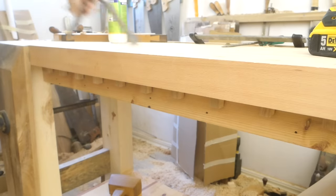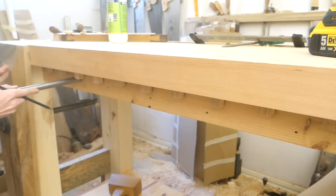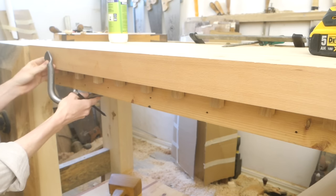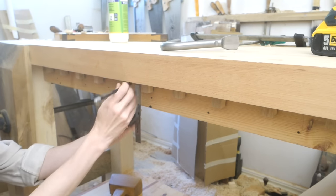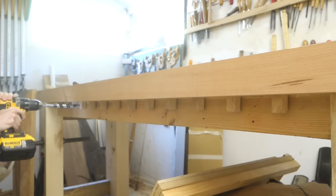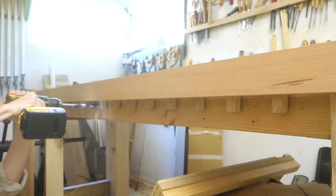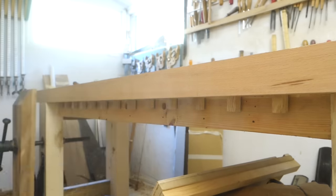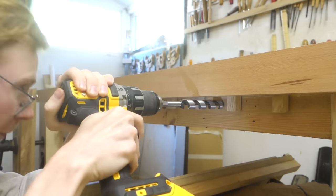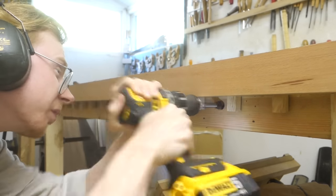I haven't used these before, but have heard good things about the Gramercy Tools version, so I ordered a couple and a 3/4 inch drill bit for the job. I spaced them so they can reach anywhere along the edge, and positioned them vertically a bit towards the top of the beam to give them the best reach and also surround them with as much wood as possible.